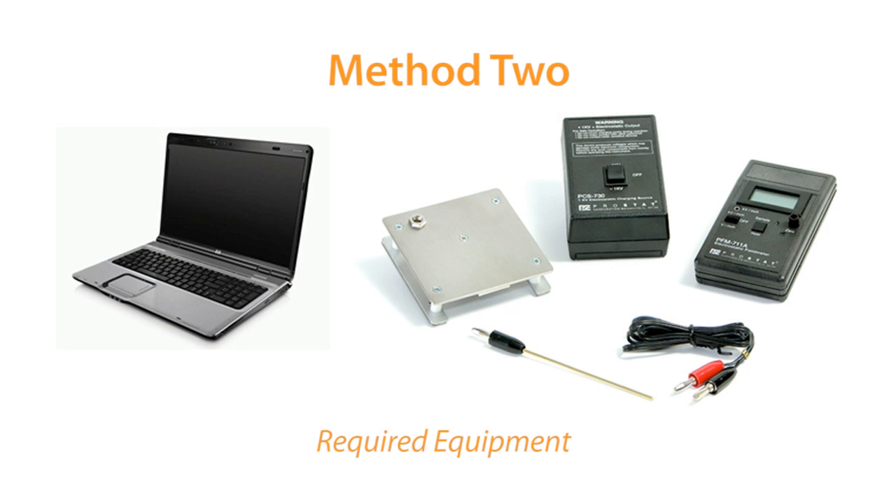There is another qualification method — Method Two. Method two requires you to go to some fairly extraordinary lengths. When you go to do your quarterly or twice-a-year audits, you need to have someone who has the equipment and knows how to use it, which means you're probably looking at engineering personnel doing the qualifications, as opposed to anyone — including the maintenance department — going out on the floor, putting down an ohmmeter, holding it between their fingers, and pressing a button.